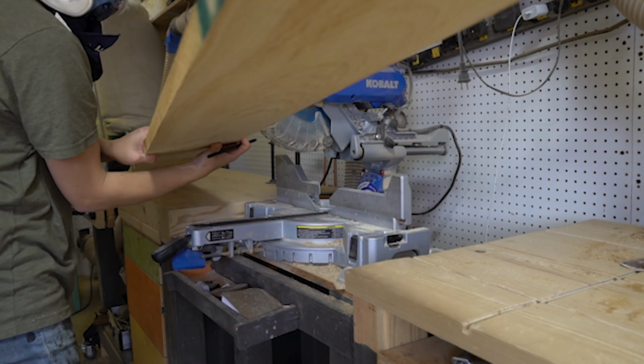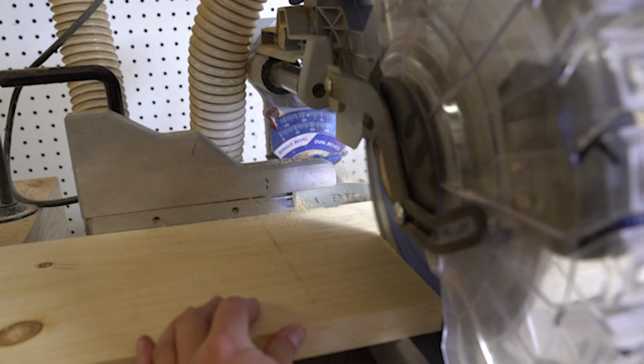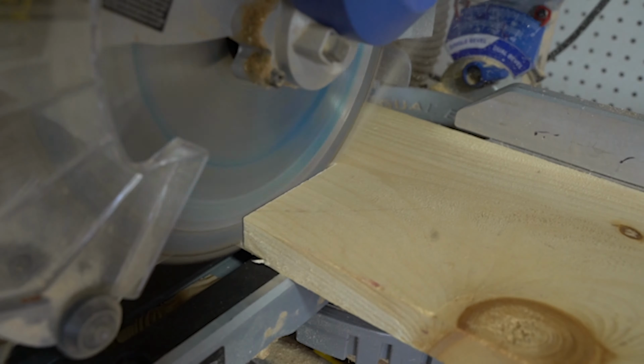This is a commissioned piece, so after nailing down the design, materials, and finish with the client, I cracked on with my first cuts into 4/4 furniture grade pine. I started by cutting the rough lengths for 5 panels and 8 stretchers that would make up the framework for the base cabinetry, the dimensions for which I'll put in the description below.